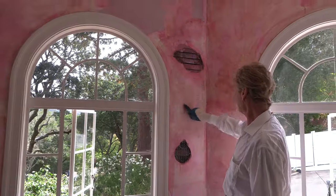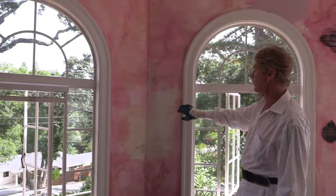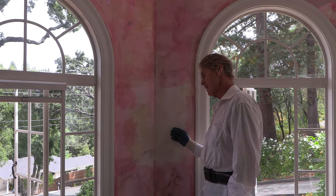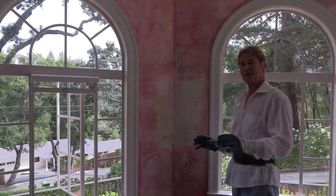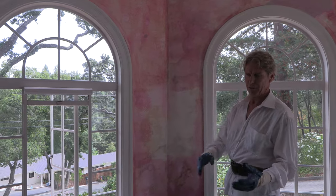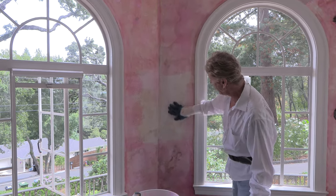Jay and I already put the Plaster Weld over it, but I left a little spot to show you. This is what we used to call white coating. Back when I first started, if I was working with Whitey he'd say, 'Kirk, mix me up some white coat.' What I'd do is get some lime plaster, put it on a board, make a little hole in the center, put the water in, and let the lime absorb the water — that way it didn't clump up. That's what this shiny stuff is.